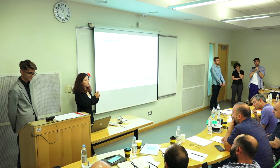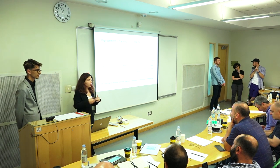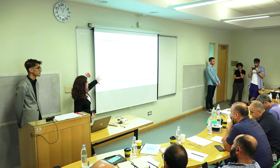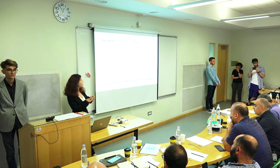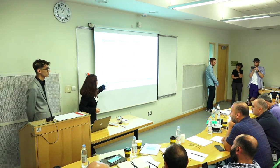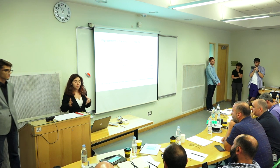Then we would attach it to the magnet. We would make the bottom metallic disc on which the magnet is to be attached. The coils were also wired by ourselves. So there are some human imperfections. The bottom magnet should also be exactly aligned with the pin, which is kind of hard to do when you're working with such small components. If the pin is smoother, there would be less friction between the pin and the magnet, and all the pins should be identical, so we don't have to do some tweaking for each pin specifically.